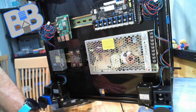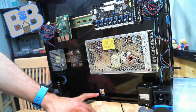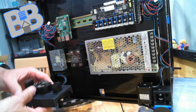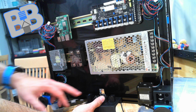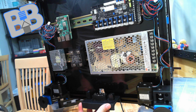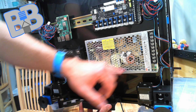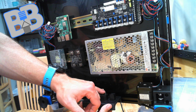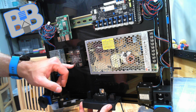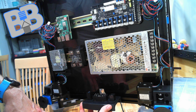My choice for putting things this way, just as a little recap here, putting our high voltage stuff towards the back because that is where our power is going to be coming in. So basically our power module or panel will be right here, with power feeding directly into our Mean Well, both of them. So probably go from here to there. And depending on how I wire, I'm either going to double terminal there or double crimp a wire in here. And then we also have power going into our solid state relay. So that's going to come in to there.